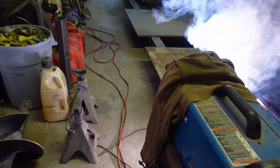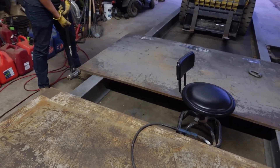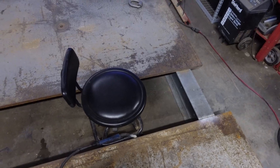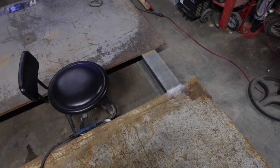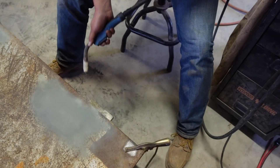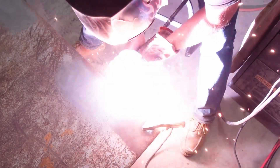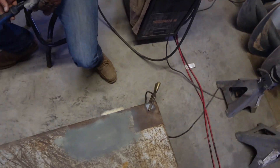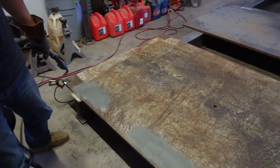Oh, this is galvanizing — don't do this. All right, give me a couple smacks. It's pretty close to square — it's not even, we're like nine inches over here and five inches over here, but whatever, it doesn't need to be perfect. If you weld with gas it's easier, but yeah. If you guys are new to the channel, I got zinc poisoning hardcore back when I was building one of my dirt screens, and that sucked — so don't breathe this stuff. We are definitely doing it for the YouTube tonight.